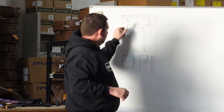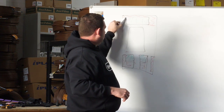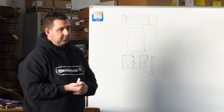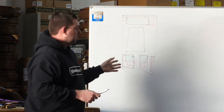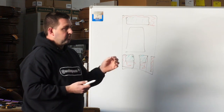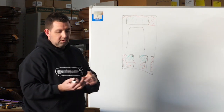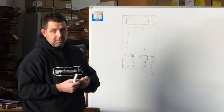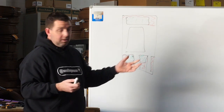Whether or not the controller can go on a wall, or if it's going to have to be put outside the house because you've got concrete. If there were concrete paths already here and they had water out here, you'd be using battery-operated valves. It's ideal if we can use mains electricity controllers as a priority, because you're not replacing batteries and you've got the option of connecting Wi-Fi so you can program the controllers remotely.